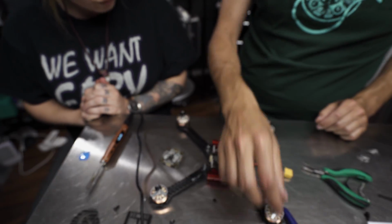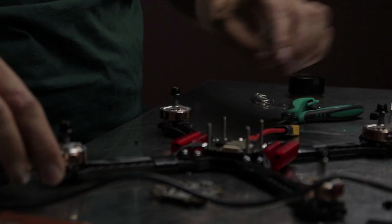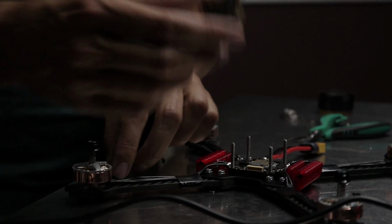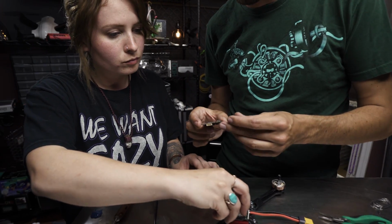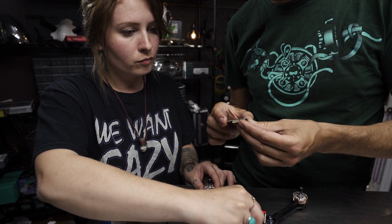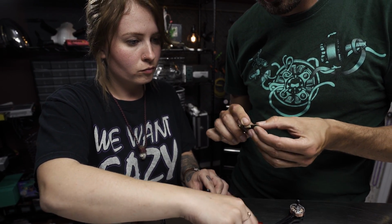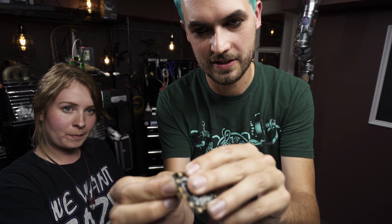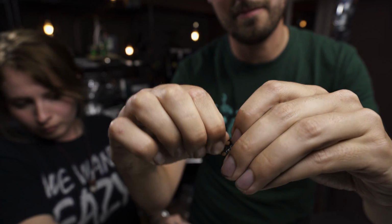So to drop that on, we need to put these spacers down on threads. So we'll take these and drop those on. And then also, this board is really nice because it has enlarged holes, and then you put these rubber grommets in there, and that isolates the gyro from vibration. Try to pinch it, insert it down through here, hold it from the underside, reach up top, grab it, pull it through.